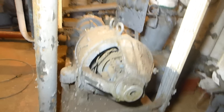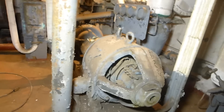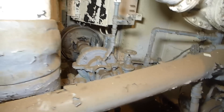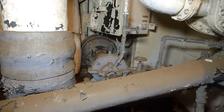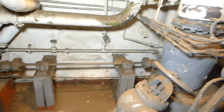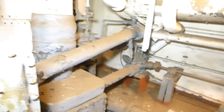In order to make this evaporator work, we need cooling water that surrounds the coils that the water condenses in, to keep them cool and condense the water. In the back corner here is the brine discharge pump. All that salt water that goes through the evaporators — very concentrated salt — has to be basically thrown away when it leaves. So this pump is used to pump that salt water coming off of the third effect overboard. We also have the condenser circulating pumps here, which help move the condensed fresh water over to the air pumps.